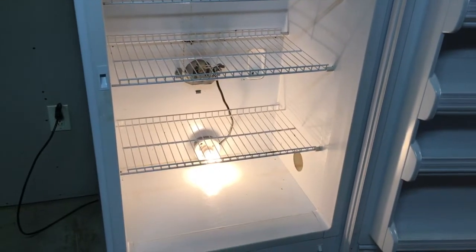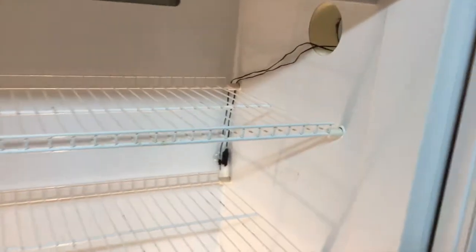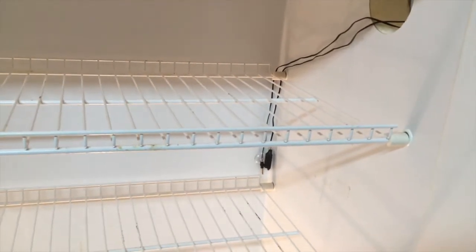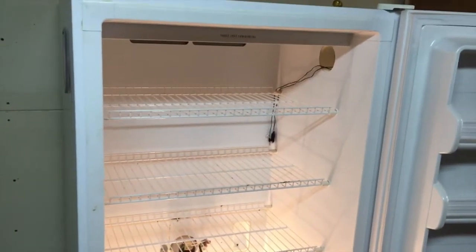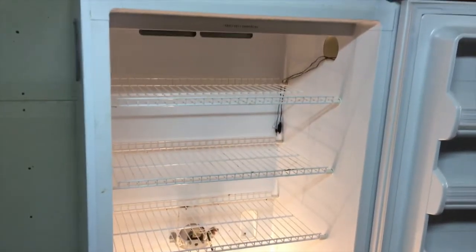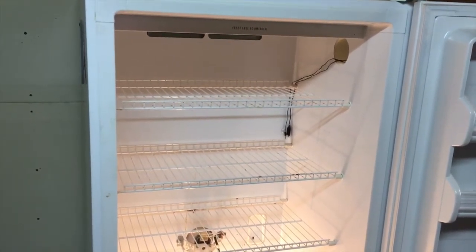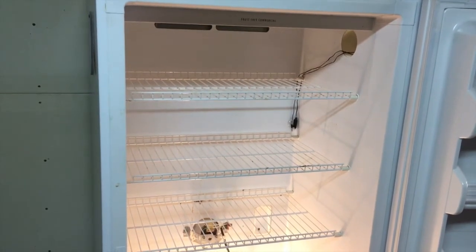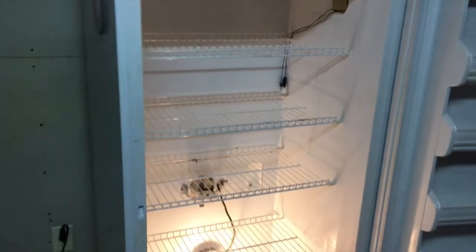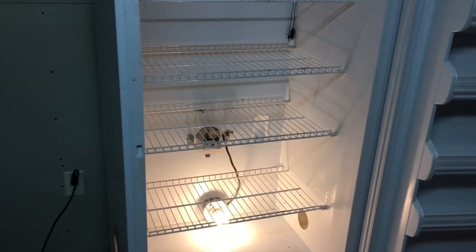As you can see, it's just a regular freezer — you need the shelves, so make sure you get shelves with it. This is the thermometer and humidity sensor, just dangling. I'm more inclined to at least monitor the temperature. From the times I have used it, once it got up to temperature and you got a humidity reading, you would see that rating going down, which I assume is what you want — you're taking the moisture out of the wood, so it slowly creeps down to show that it's working.